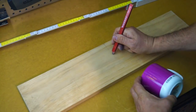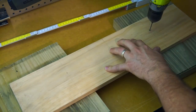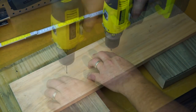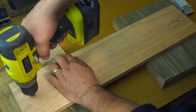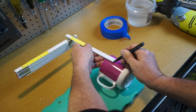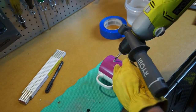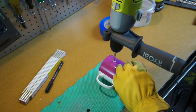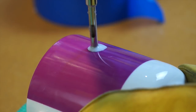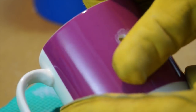Hold your cup in place and check the spot before marking for the fixing point. Transfer that height to your other lines for your other cups. Then pre-drill for the cup screws — just make sure you don't over-drill. Now's the best time to pre-drill and countersink for your backboard mounting screws too. To drill holes in your cups, you'll need some diamond-tipped core bits suitable for glass or tile. Make sure your drill is not on a hammer setting and is only running reasonably slowly. With your cup on a soft but stable surface, start on a slight angle to get a bite, then straighten up once cutting. These bits need to be kept wet when drilling — dip the tip of the bit in water about every 20 seconds.